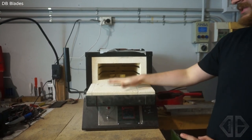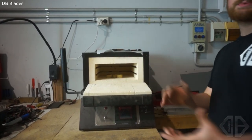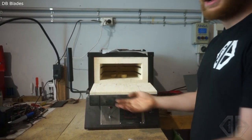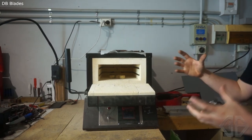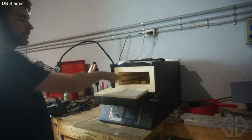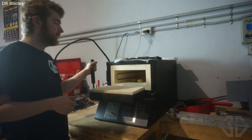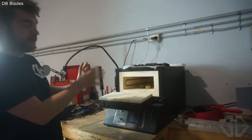Now the things I don't like about this kiln. The first is the door. I believe in the newer options the door has been changed, but the way this door opens out, I just don't like it. We're knife makers and we don't usually wear gloves, so if you're sticking your hand in here without gloves to pull something out, you've got a big amount of heat right up against your hand. That's obviously sorted if you wear proper gloves, but that's not always ideal. Also the door really needs some sort of soft close feature, especially for doing classes. The problem is that because the door doesn't have a soft close, I'm worried about a student trying to pull his knife out as quick as possible and then slamming the absolute hell out of this door. When I close it I'm very gentle, because this is all very fragile — the last thing I want is someone who doesn't know what they're doing slamming it at full force and smashing my insulation and bricks.